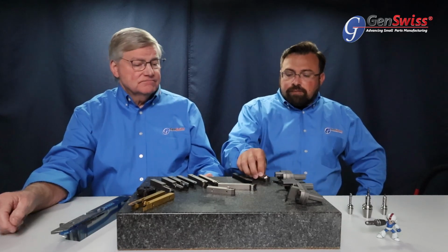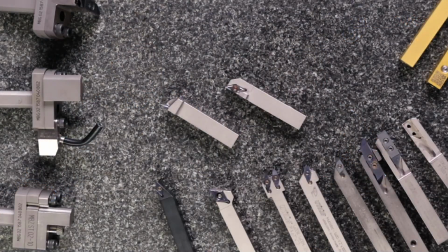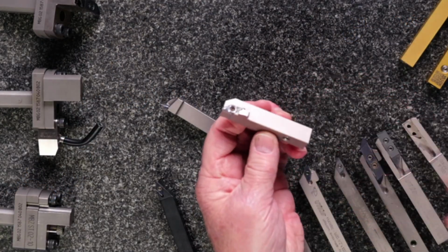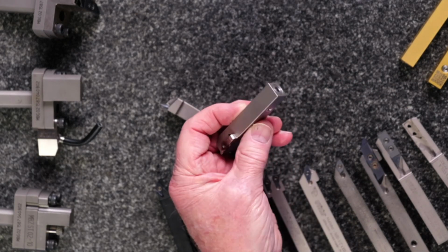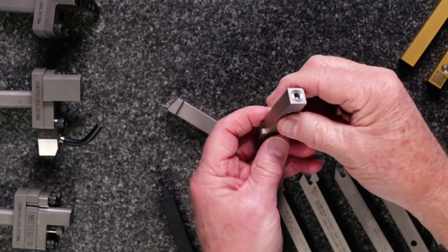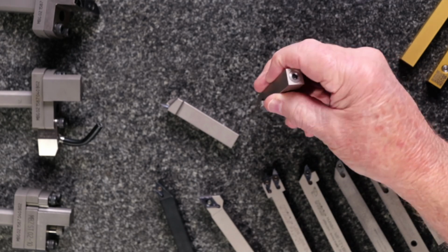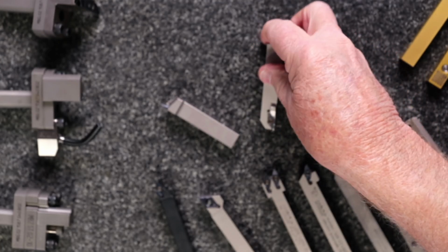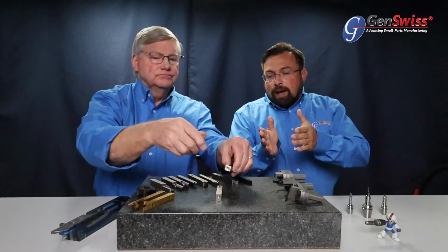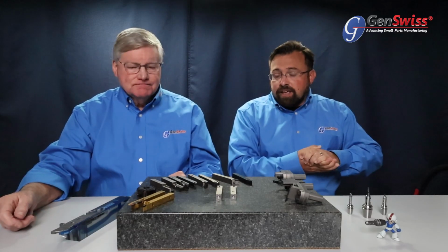Yeah, so some of the existing products that are out there on the market for quick change on the machines involve a tool plate, where you've got a split wedge design, with an upper stop and a lower wedge. So we've got an entire product line that's compatible with systems like that, where you would use our half of the shank on the lower part of the wedge to install onto your tooling gang plate and utilize the quick change that you might already have. Maybe it was delivered from the manufacturer with the machine when you purchased it. But now it gives you the option to use any of the Utilis geometry in your production capabilities, so it gives you a little versatility. Some more versatility.